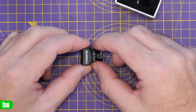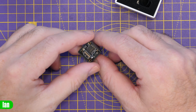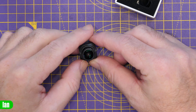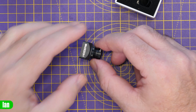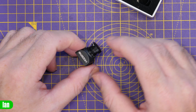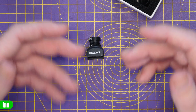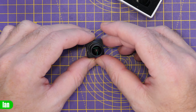This camera is fitted with a half-inch sensor with a native resolution of 1920 by 1080, meaning in 1080p mode you're getting that full native resolution. In 720p 60 you're getting an oversampled image, which is actually going to give you higher quality than what you were getting on native 720p cameras before. As a result of the sensor changes it has sharper optics as well as better low light performance, making it the best camera option for people flying general freestyle or slower flying in that 1080p 30 mode where you want the best possible image quality.